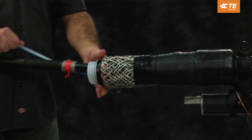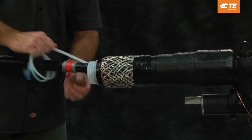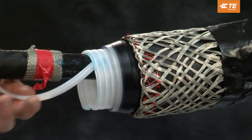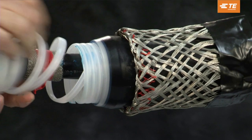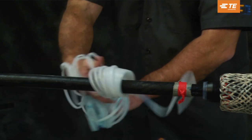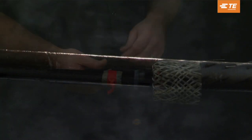Release the spiral holdout by pulling counterclockwise. The spiral holdout cannot be pulled out all at once — slowly pull the spiral holdout on top of the cable, then pass it around and underneath the cable until the spiral has been completely removed. Remove the spiral holdout off of the cable jacket. Clean the cable jacket of any remaining DCC compound.